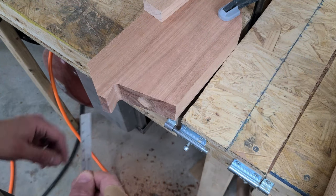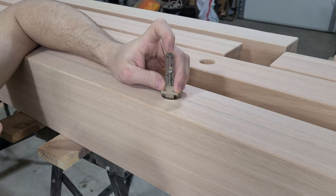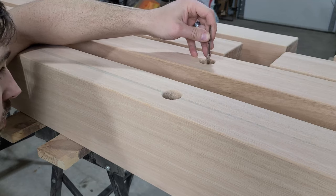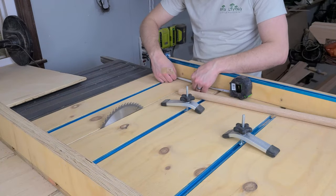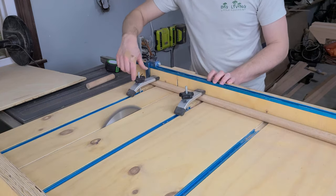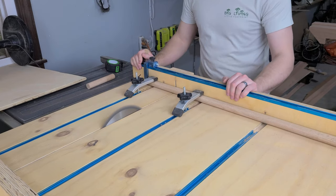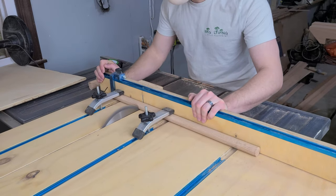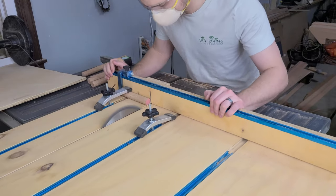The last thing we have to cut is the dowels for the headboard supports. Our Forstner bits weren't quite long enough to drill as deep as the spade bits we had used the last time we made this project, but they made much nicer holes. We started by measuring the depths of the holes in the headboard supports and the holes in the bed frame, and then cut the dowels to be just short of the smallest combination of holes. This way, the dowels never bottomed out when the headboards are installed. Remember to clamp the dowels when cutting them on the table saw and keep your hands clear - the blade can catch and roll the dowels.